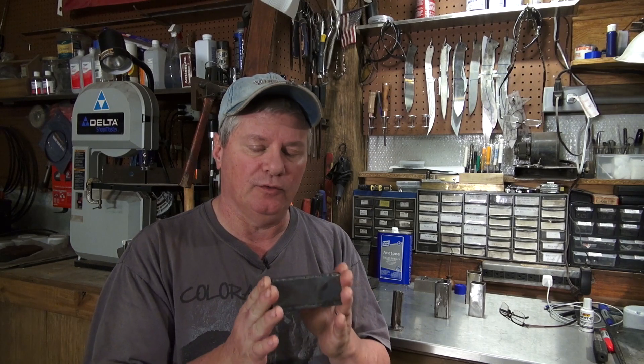Let me talk about what I've got here and what we're going to try to do. I took a 16-gauge stainless steel plate and made a tube with it — just welded it up. It's about three or four inches long. I'm more or less doing some tests here, and if I can get the results I want, then I'll make some bigger, larger billets and different mosaics.